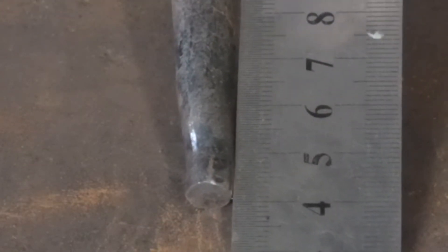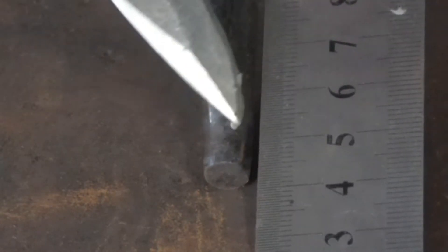Maintenance and dressing of tapered punches — specifically my tapered punches. I'm holding a ruler against the edge of this punch and you can see the gaps as I bring it down, especially at the point which is off to one side. There's a massive gap back here as well, which shows me the punch is by no means straight.